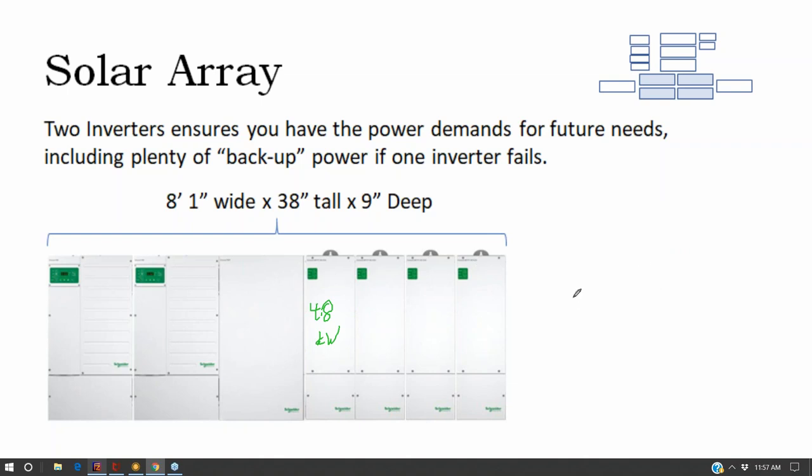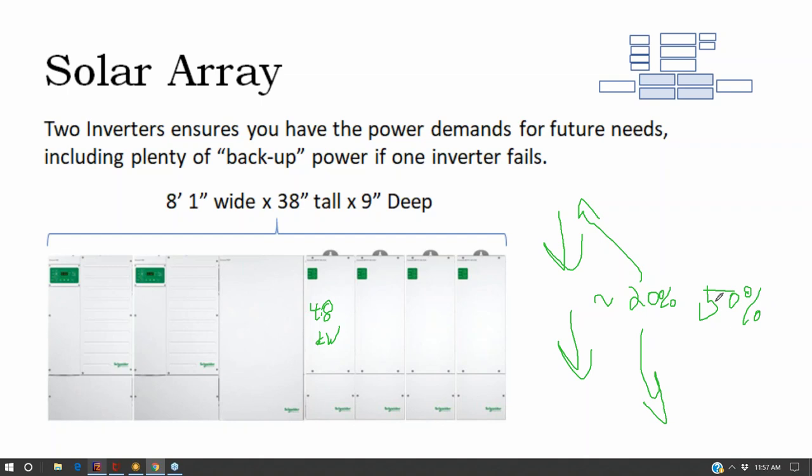And in grid tied solar, you're trying to output every kilowatt hour onto the grid. So your solar in and your output is about 20% upsize going from solar to the inverter output. And off grid, I'll often go for a 50% upsize. That's because on a sunny day, you're just going to have stranded energy. It's on those partly cloudy days, when all the panels are producing half of what they normally would, that the 50% upsize becomes within the range of your output capacity.